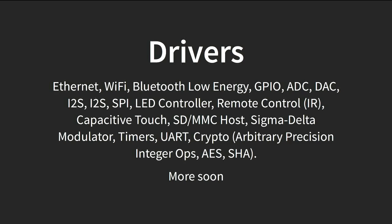At the moment ESP-IDF only supports FreeRTOS, but there are other RTOS options coming. NuttX already has support for the ESP32 — you can boot NuttX on it, though peripheral support is still a work in progress. The other big abstraction beyond the real-time OS is drivers. ESP-IDF has drivers already included for many peripherals, with more landing every couple of days, so most of the major hardware features have a driver you can use rather than having to poke at the hardware directly.